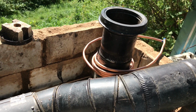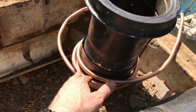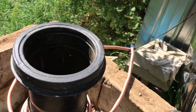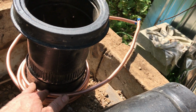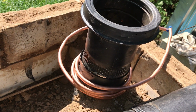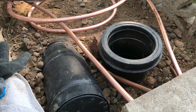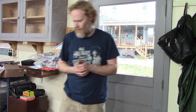So I got some copper tubing, I think it was 1/2 inch and then 3/8, and I ran that through a few times, about 20-30 feet. I had some going around the stovepipe directly, which a lot of heat comes off of. I also had some going through the main mass of stone as well, and as the heat would rise up, hopefully that'll be captured. Later on I can run a pump through there and a mixture of water and antifreeze, and then hook up some PEX tubing hopefully to that and run it along our floor here for radiant heat as well.